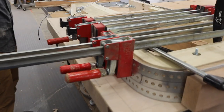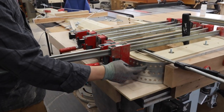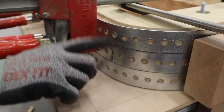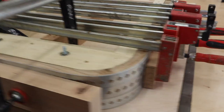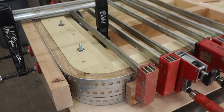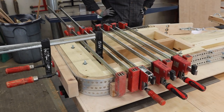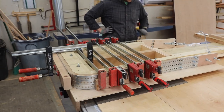This strapping — I see a weld right here. Our buddy Manny welded these up for us. They only sell these in six-foot lengths, but these are nine feet long, so we have staggered seams — one seam here, and on the other side two seams. This is called punched flat bar — it's just one-sixteenth-inch-thick zinc-coated steel. It's pretty common; you hang garage door track from it. This came right from Home Depot.